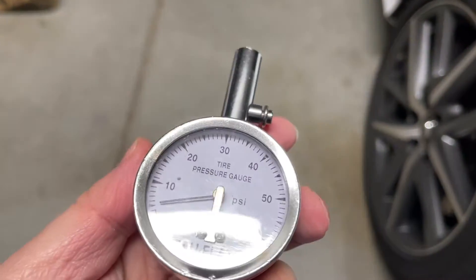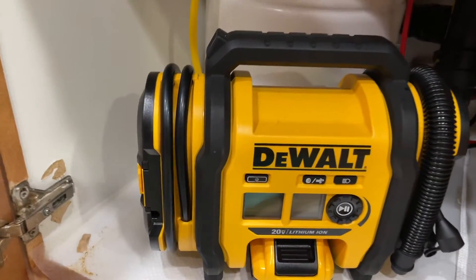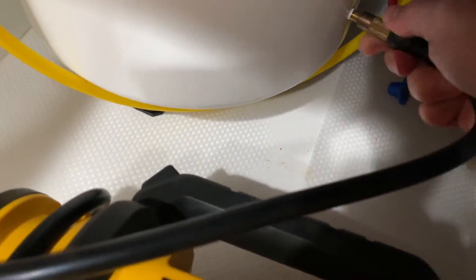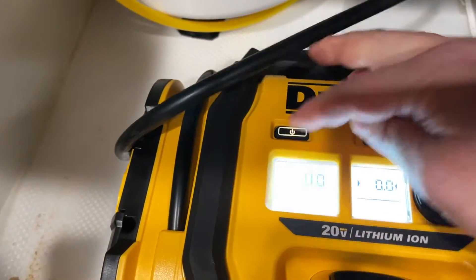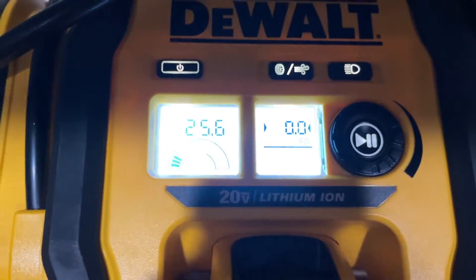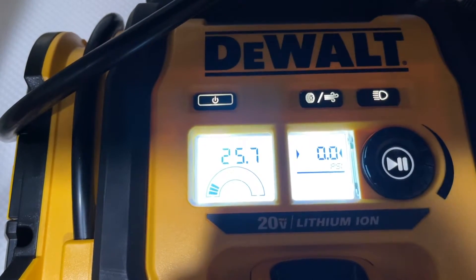Simple as that. You can also use a tire inflator that has a gauge built in. That's simple to do — just connect it. I did this just to prove that the pressure is really hitting the tank. What you do is put this over here, and if you have this inflator you just twist the knob, turn it on, and you can see the pressure. You'll notice that the pressure is actually gradually increasing, which is a bad thing. The tank is getting a lot of pressure — it hit around 30-something psi.